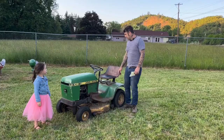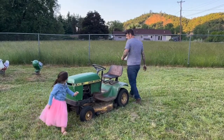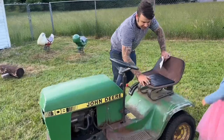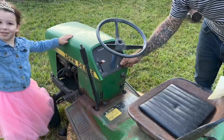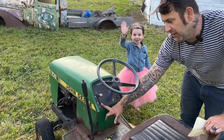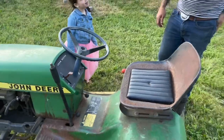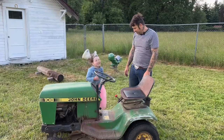It's spring, so it's got a spring seat — it originally had a big yellow pad here but those get destroyed. The five-speed is over here; this is your mower deck drop, and this is a lift stop to choose how high your cut would be. It's got a parking brake, and this is your power take-off for the mower deck. Your choke very cutely has a rabbit for fast and a turtle for slow — they wanted to be a little cheeky. Little tractor, little video, little girl!